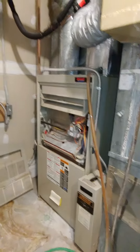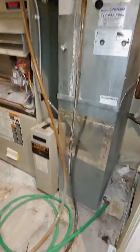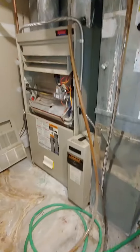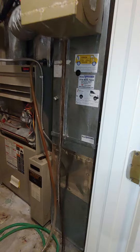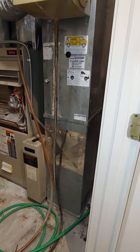We're looking at the indoor unit here. We're going to be replacing the furnace most likely. We'll do a new return drop and a new 5-inch media filter. The old one is huge and we do not have a ton of room to get through, so we will have to remove all this probably just to squeeze it through — but it'll just be a little bit tight.